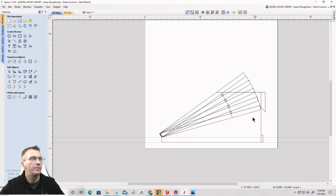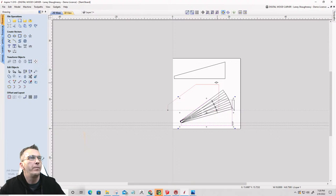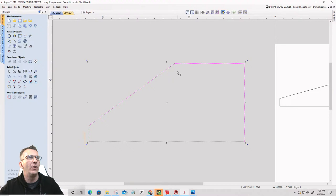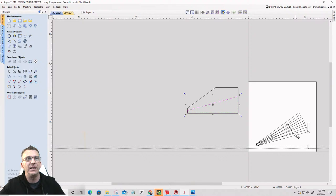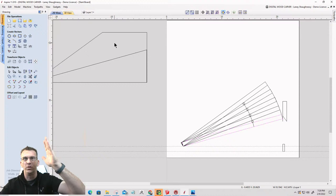The first side piece — I'm going to have my sidewall. These are going to have the holes. This part here will be on the inside and it's going to be three-quarters of an inch wide — it's going to be a shelf for the plank to rest on when it's in its resting state. The plank will rest on there and then there'll be holes where I'll be able to transition from that 15 degree — that's its resting state — to 20, 25, 30, and then 35 ultimately is going to be the highest.